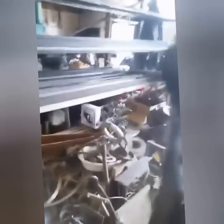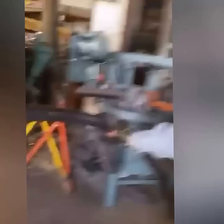We'll keep going one or two more times. It just takes a little bit of time, but this tool beats doing it manually — believe me, I know, I used to do it manually. Once we get them to the right curve, we take them over to the Ellis saw and we get three three-footers out of each 10-foot piece, so from a 20-foot pipe we get three sets.